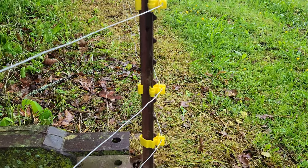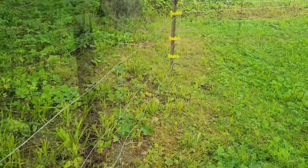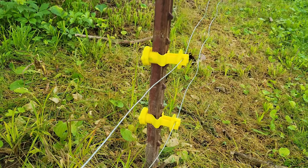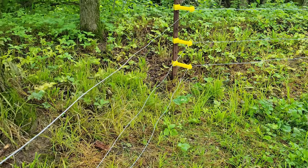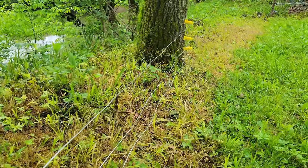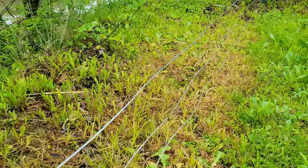We really want this video to be a step-by-step portrayal of what we did for this fence; however, we just weren't able to get footage of everything along the way because we were trying to get it done and some steps required all four of our hands. We used five different types of insulators here. The favorite was the little clip-on T-post style. The screw-on insulators weren't quite as secure — I won't be using them in the future. The extended clip-on type are just not very strong for wire fencing. We also have some that drove straight into wood posts or trees, and then in the corners we used the black round corner insulators, where I was able to tie off the wire and stretch against them.